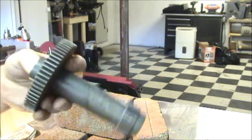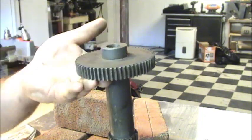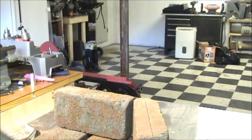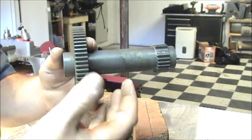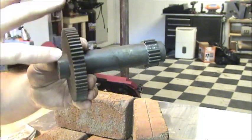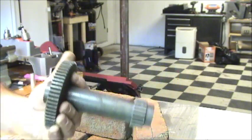Line the bottom with lime, put the part in there, cover the part completely to the top with lime. Unfortunately, I'm not in the mafia, and I'm not a gardener, so I don't have lime lying around. What you can use is clean sand. It does the same thing. And what that does is slow the cooling process down on the pot. It'll cool evenly and it'll cool slow. It may take even as much as a day or two to cool completely off.